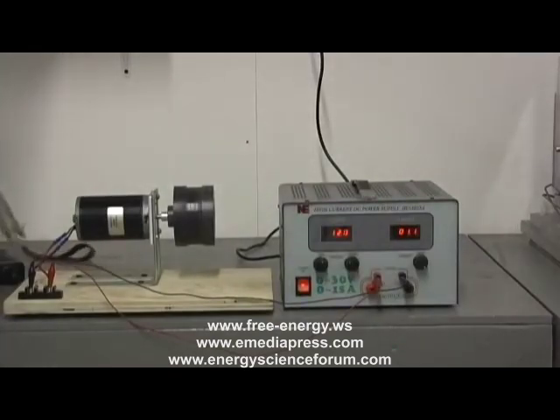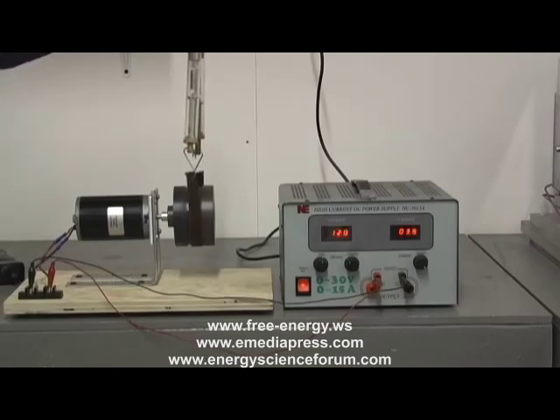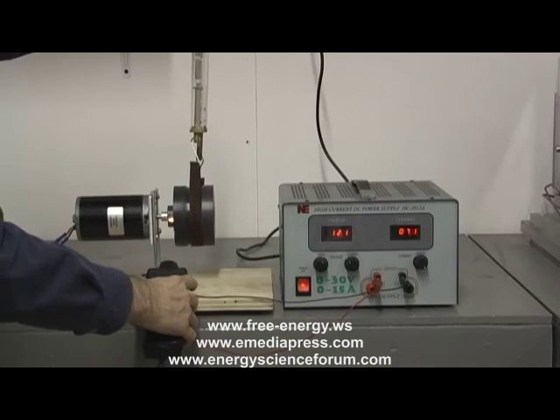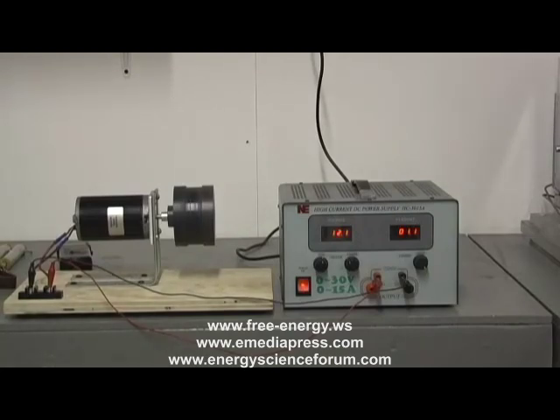So let's take some measurements and see what we get. I'll put the strap with the spring scales on, holding them with one hand, and use the tachometer to shine a spot on the wheel. I'm going to bring the current up to 7 amps. My readings are 1,864 — about 1,868 RPM — with a deflection on the scales of 700 grams. You have to take all four measurements simultaneously, and now we can calculate.